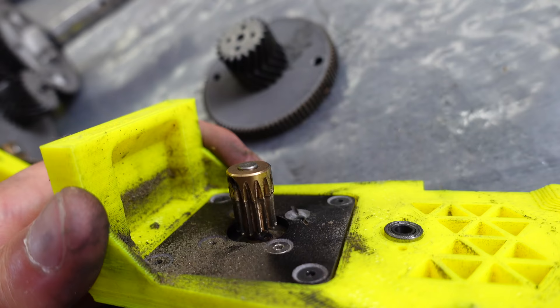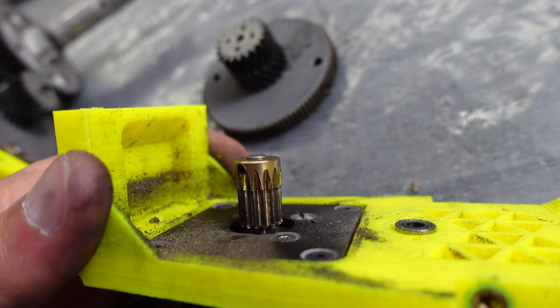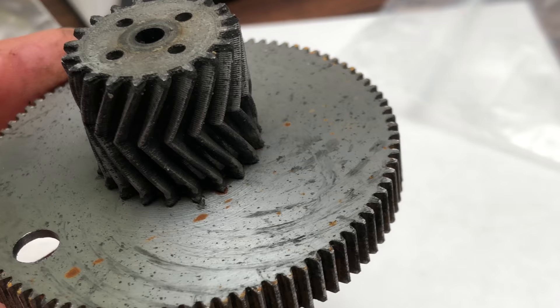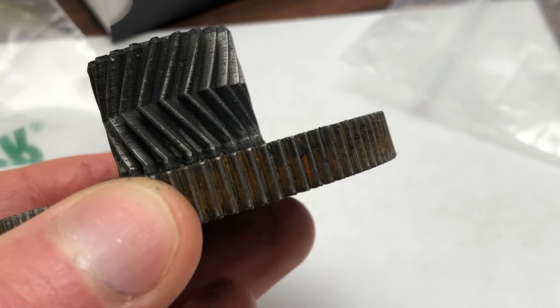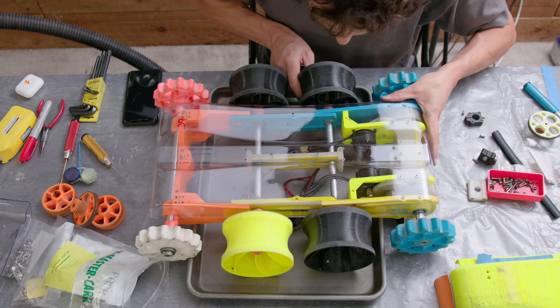At this point I was using brass pinion gears, and since these metal gears have little FDM printer ridges in them, they were really wearing out the brass gears quickly. So I switched the 3D printed 93-tooth gears over to some machined steel 93-tooth gears. These were plan of record for the kit for a while, but I switched away from that partially because they were going to be like $10 each gear — so $20 per snowcat kit. But it helped slow down the erosion of the brass pinion gear.